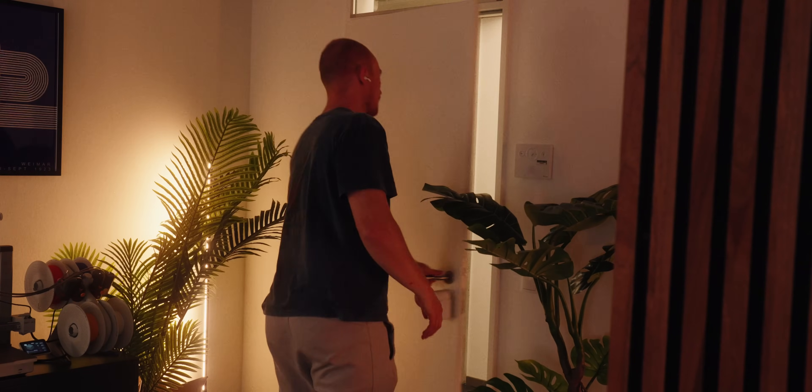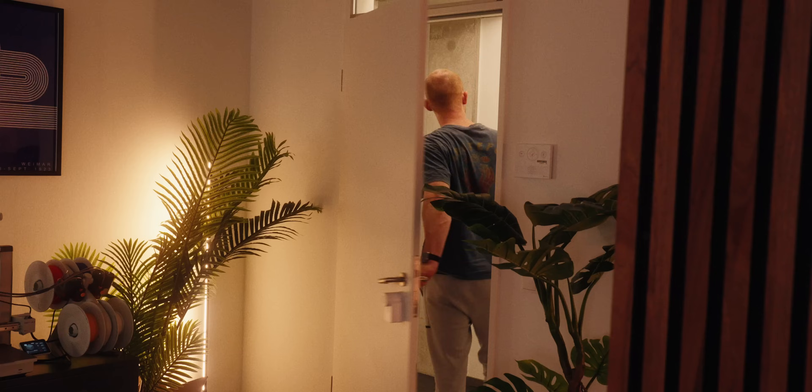I just want to add that even with something like this air purifier, there's still a lot of smell of burn or molten plastic in the air. So there's definitely still stuff that you probably shouldn't breathe. Ideally, do it fully outside or in a very well-ventilated room — just leave the area while it's lasering while still monitoring it somehow, or use a mask or some kind of personal protection equipment, because if you're doing this especially for longer periods, it's probably not healthy.